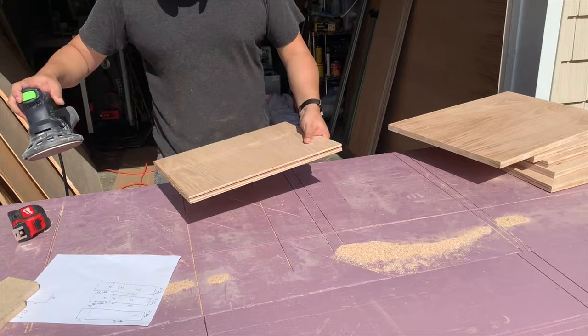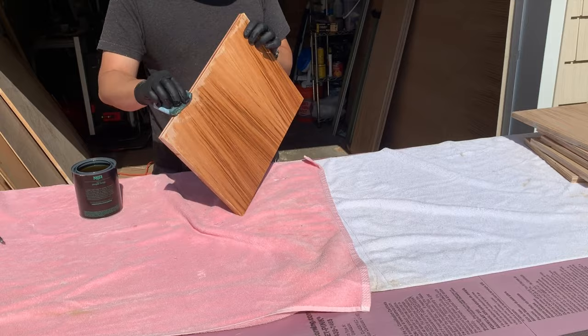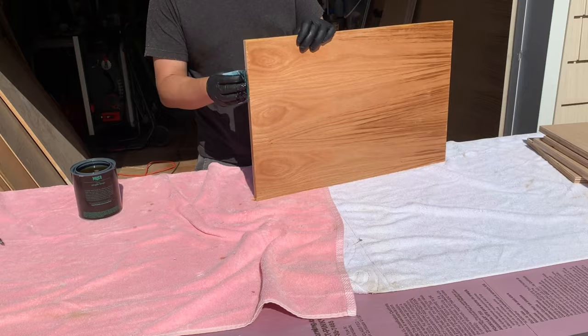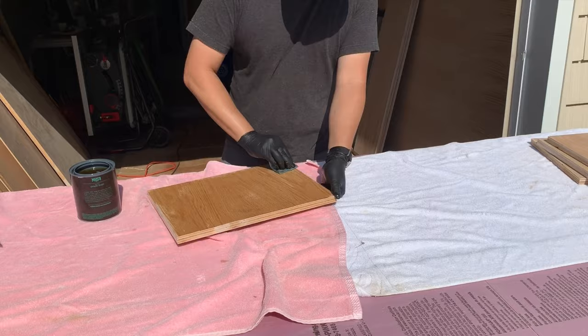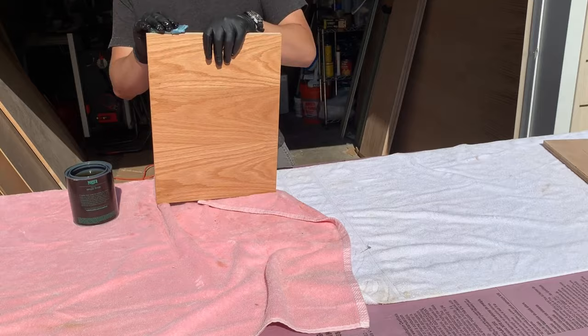Sometimes plywood has a little rough edge. After sanding I'm using this finish — Simple Finish from the Modern Builds podcast guys. I like the name; it's super simple. You just wipe it on with anything — a rag, paper towel, brush, whatever — wipe on, wipe off some of the excess, let it sit for a few minutes, put on a second coat if you need to, but you don't need to if you like the first coat. I just did one coat for this.